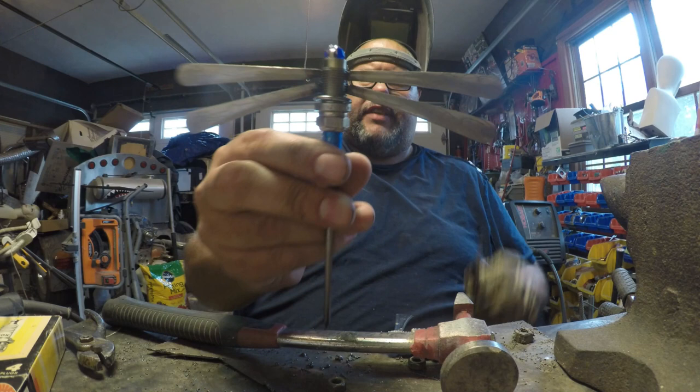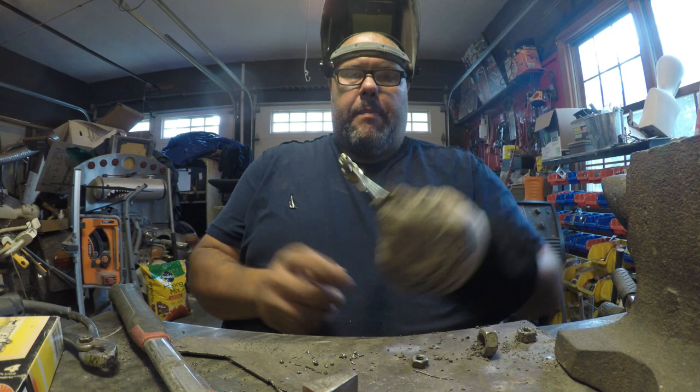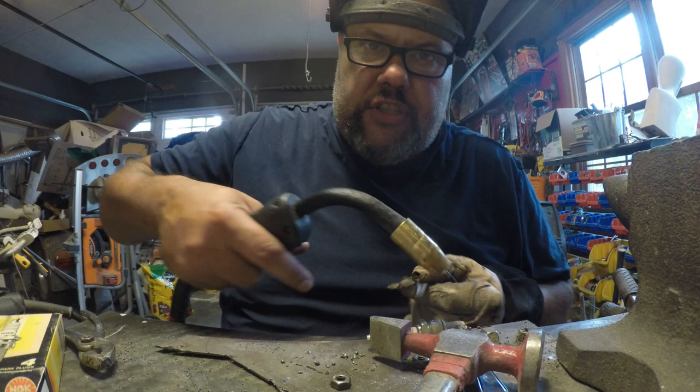On the second wing I like to give it a little bit of angle. The spark plug is a little girthier than the ones I normally use so it's moving around, but we'll line it up and tack it on. While it's still warm you can adjust your wings to make sure they're parallel to each other. There's the first two - now flip it over, drop a hammer on top of the welded wings, hold the next ones in place, and make sure you match from side to side so they're even.